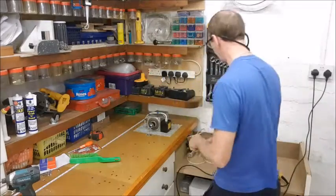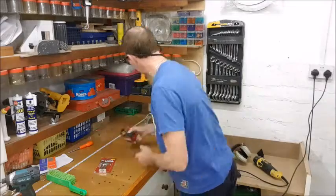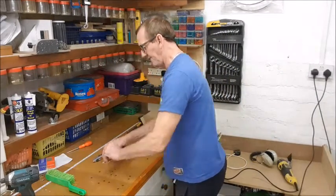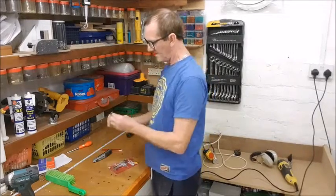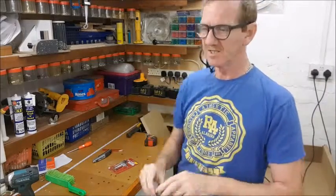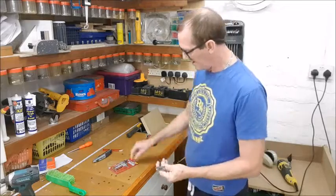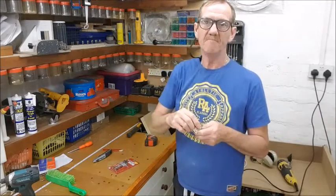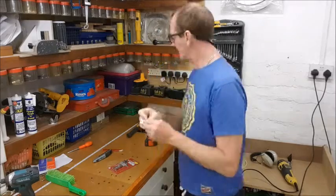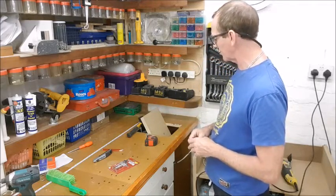Next thing is to site these deadbolts. Start with the first one. Now when you're fitting these ones, they have a little point in the tip. And the idea is you put this into the body first, which will set it into there where I want it. Close everything up, using the key, lock it, just enough, and it will give you like a down point. It's the same thing. It'll put a little indent into where it wants to be.